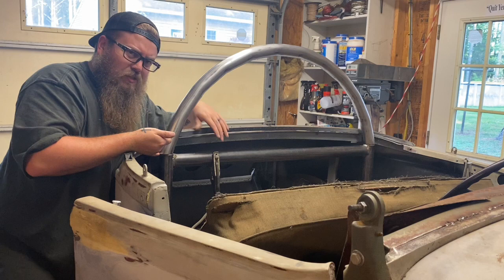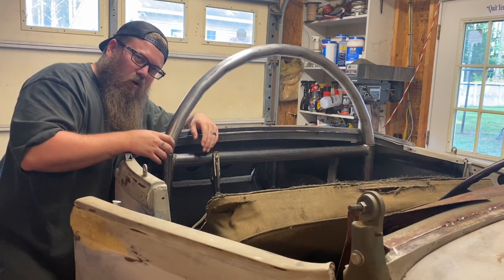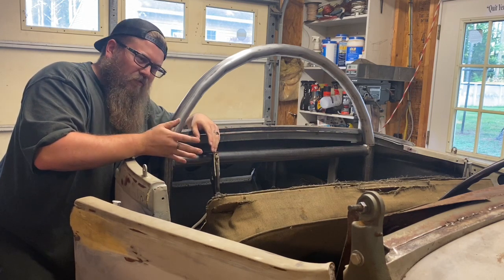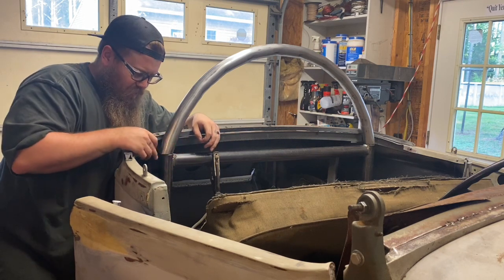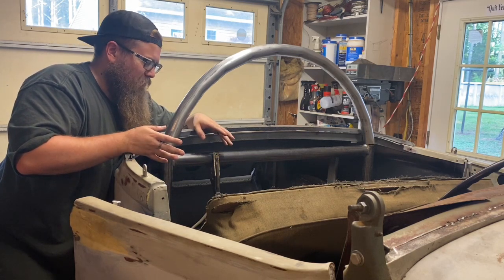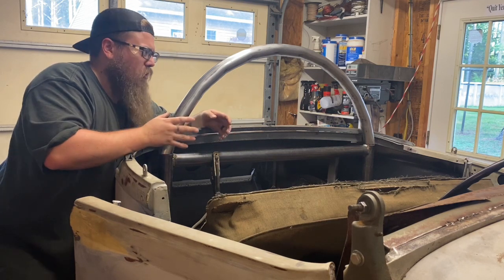I'm hanging over the edges a little bit. So instead of grinding it down, thinning that wall out to get my edges perfect, I'm just gonna go ahead and weld it up. So it's not the most perfect fitment in the world, but I don't wanna sacrifice any of the thickness. I beveled my edges on both pipes that I'm going to weld together here. So the goal is for it to be as strong as it possibly can be. That's all I want out of this, strong safety.